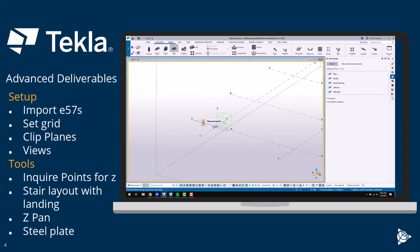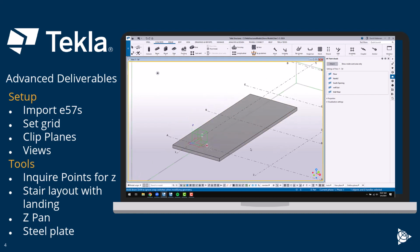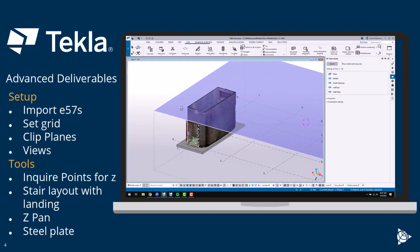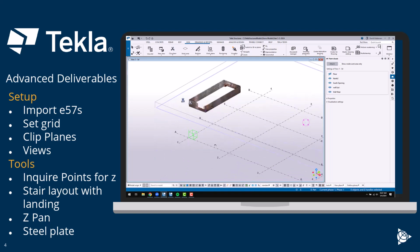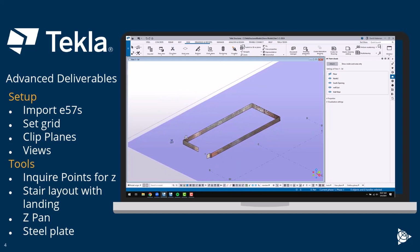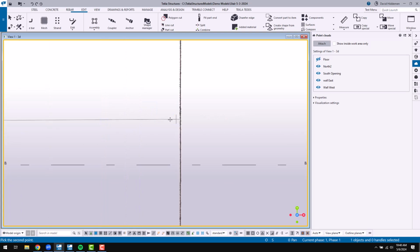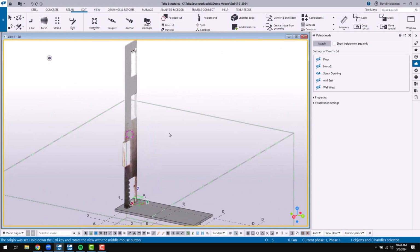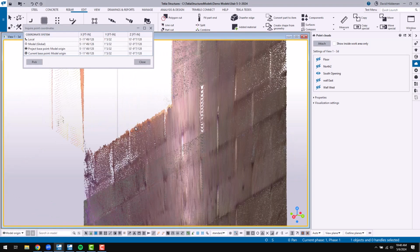At this point, though, what I want to do is set up my space to work, basically setting up my grid. I'm throwing in a quick slab to represent my floor, and I'm going to turn on the walls that were measured with the scanner, and throw in some clip planes so that I can identify a point on this wall or a section of this wall that I'm going to use for my grid. So you can see here that I'm slicing down a pretty small section of the wall so that when I flip into a plan view, I'm getting a very distinct area here, and I can measure along the width, and along the height, and then also measure the elevations from one of those walls using this inquire point coordinates tool.